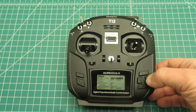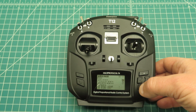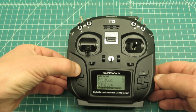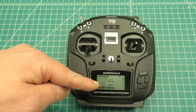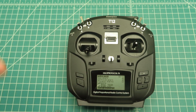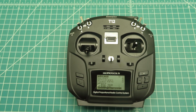And so what you want to do here for a telemetry receiver is you want to go over to the telemetry page here, and you want to go down to the bottom here, and you want to hit Discover New Sensors. And so you'll see that RSSI comes through and the RX battery voltage, which is the 5 volts going to the receiver. If I have this plugged in to a LiPo, there'll be a lot more that come through. So you want to repeat that after you plug in LiPo. But just for now, this is fine. So you can hit stop here. And so you can see I got RSSI here showing up at about 100 dB or so. So you want to make sure you do that for telemetry receivers.